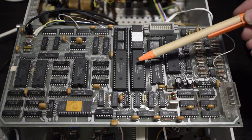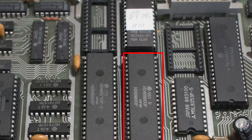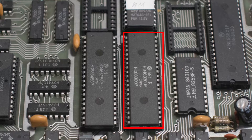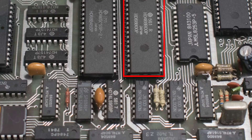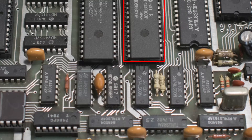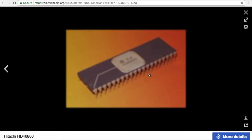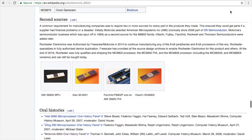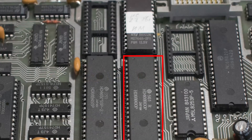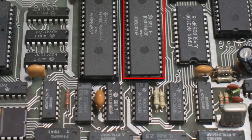The main star of tonight is the Hitachi HD6800P — fancy name. It's working in our case at 2MHz and it's basically a second source of the Motorola 6800. It was a common requirement for manufacturing companies to require two or more sources for every part in their products, to ensure supply in case of financial problems or local disaster. These are all licensed pin-compatible versions, and you can still get second sources of the Motorola 6800 even today.